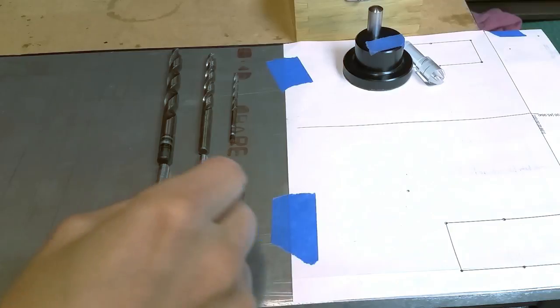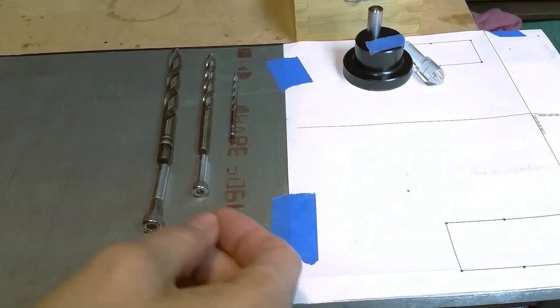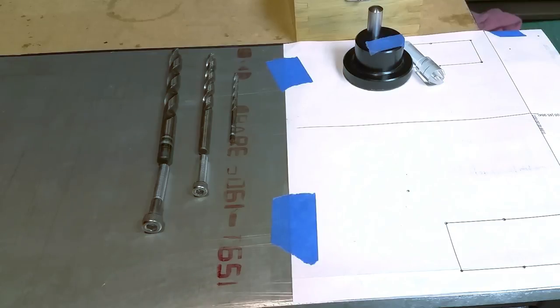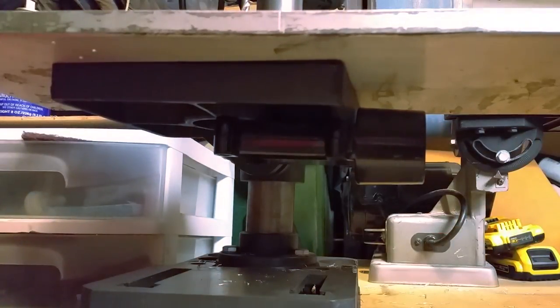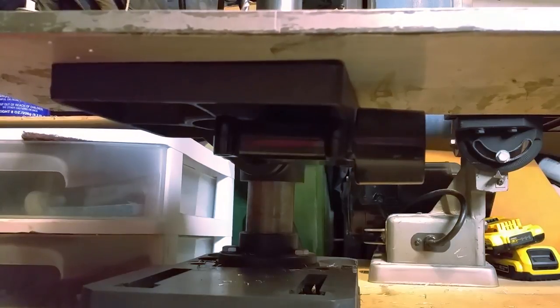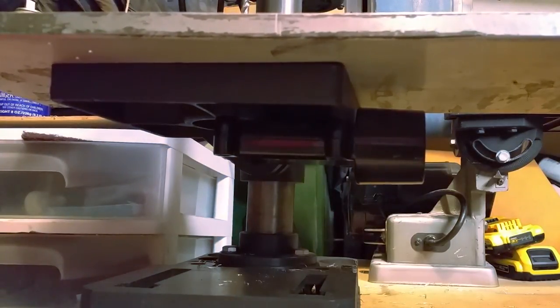At the same time, you don't want your washers to pull through, and you have to make sure you can provide enough clamping pressure to hold the thing together in a machine that's vibrating. And so lock washers and Loctite will be necessary. I'm trying to make sure that there's no gap here, so I'm just adjusting the little jack I made so it sits pretty level.